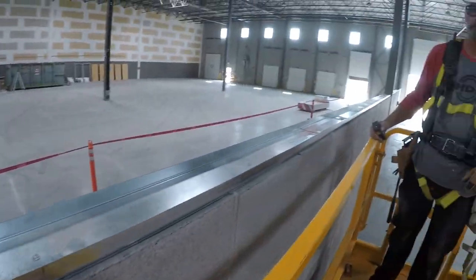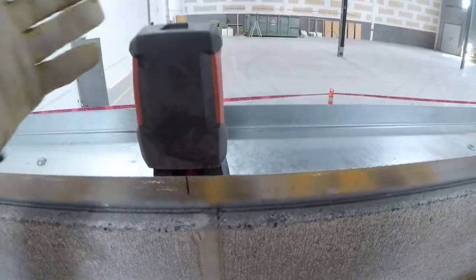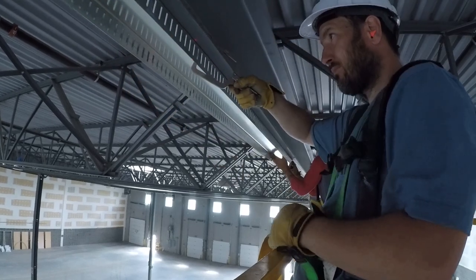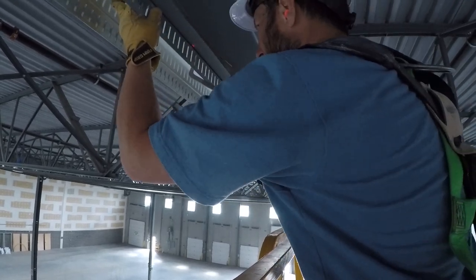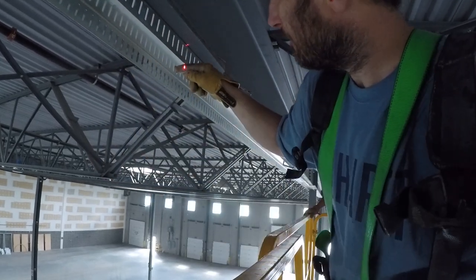So clamping on the beams — you want to split the beam. I like these nine-90 arc clamps. I'm plumbing up just the far end of the top track and I'm using the last 16 on that 10-foot section — plumbing up the 16 and plumbing up the track. For the first piece in the wall I need two lasers; after that I can just butt one end into the track that's already shot in and laser up the other end. It's also plumbing up the center for the 16 — for the stud splitting the beam. With slip track and different types of track, you have to be the judge. Sometimes you want the beam a little more inside because it's wider than the bottom track. Just know your steel, split your beam consistently through the whole wall.